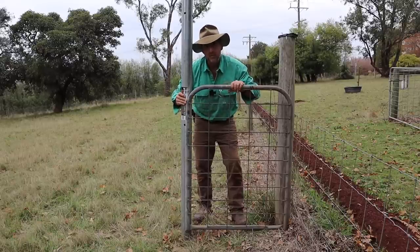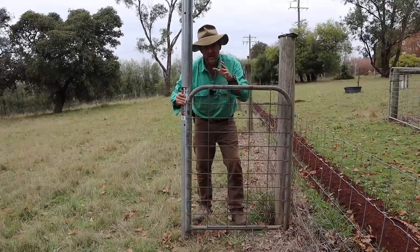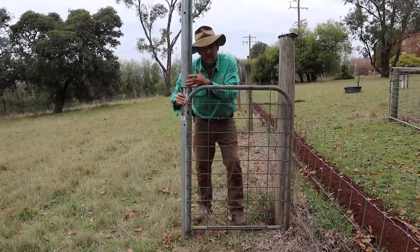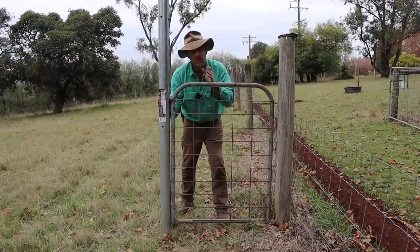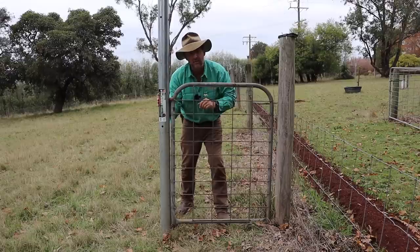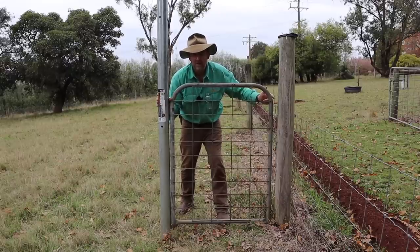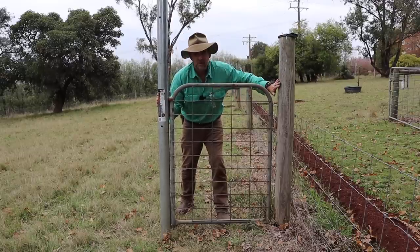Setting out your gate distance when you mark for your end posts is actually really easy. For a side-mounted gate for livestock, you want to go centre of post to centre of post the exact length of the gate — so for a 12-foot gate, that would be 11 foot 10 from centre to centre; you ignore the gap. However, if you're measuring for an end-opening gate suitable for machinery in both directions, you ignore the centres of the post and measure the gap instead. Leave 2 inches for your gate furniture, and I like to leave an extra inch for your chain hanger at the other end — so for a 12-foot gate, you'd measure 12 foot 1 inch between the inside of your end post and the inside of your latch post.